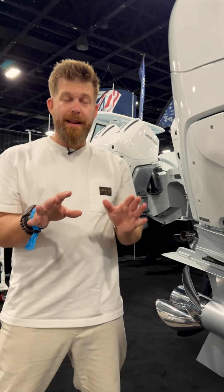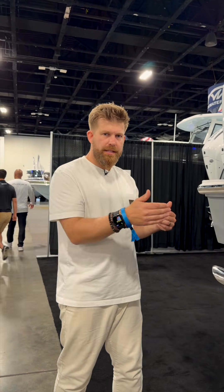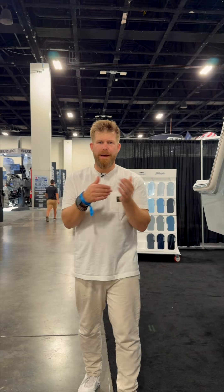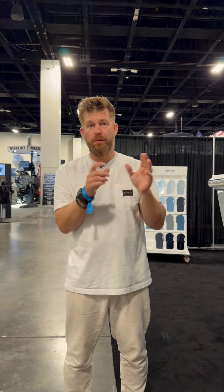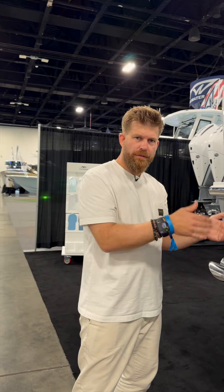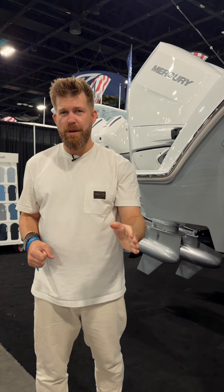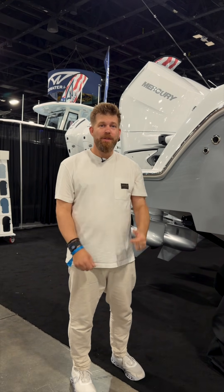You want to have a nice balance between stepped hull design and having a planing pad that's not too shallow. Traditionally on a stepped hull, the last section is a little less of a proper deep V because you want a balance of performance and offshore capability. So you'll find in this type of design you'll have a much greater deep V in the forward section and midships, and then it will tail off at the aft section. That gives all of that punch to cut through any wave you want, but then the balance of economy and speed once you get going.